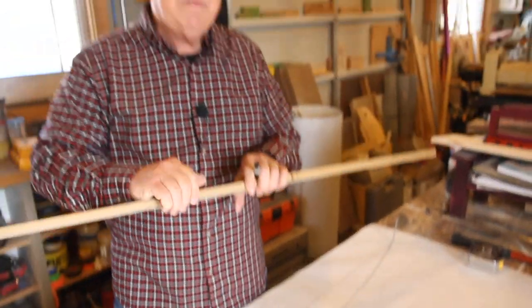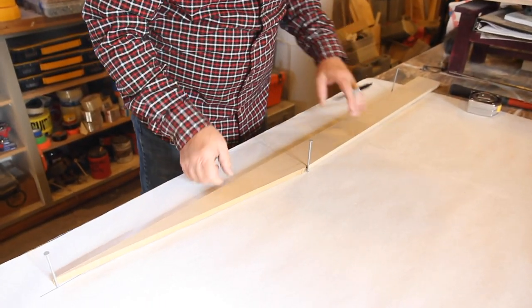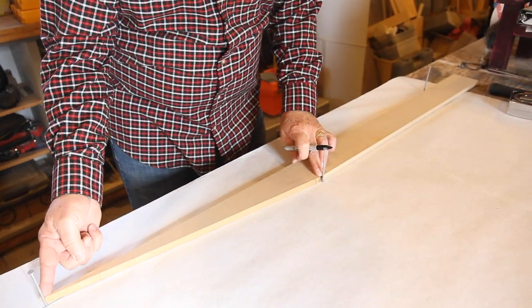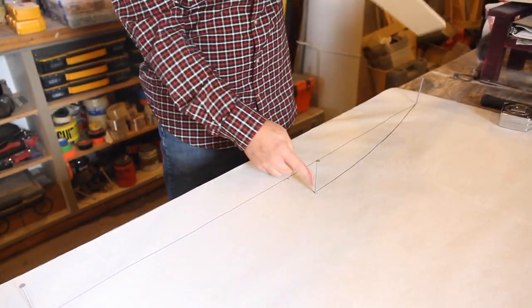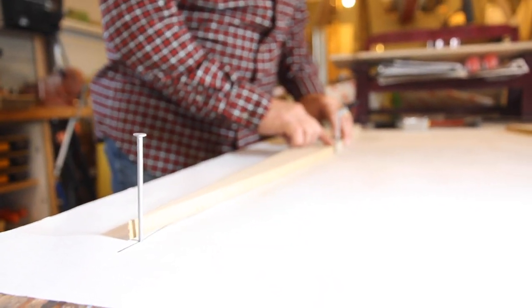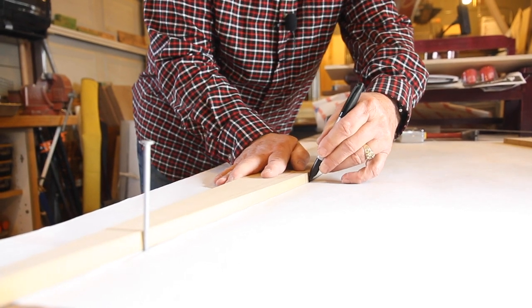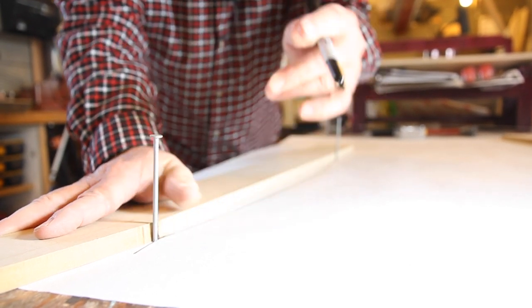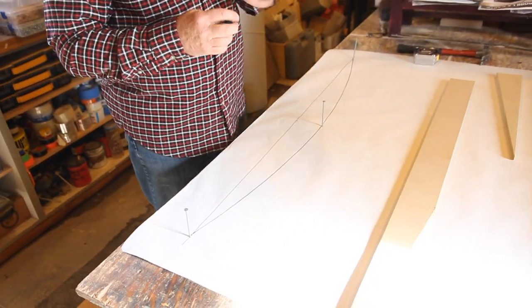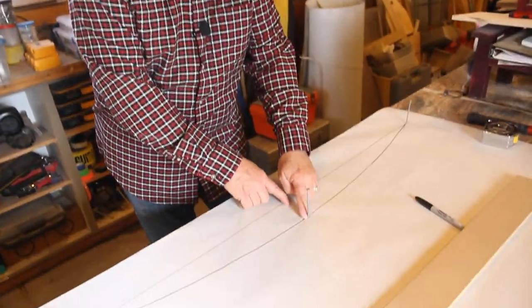Now you can see the arch that was formed. You have a couple of choices: you could flip this around and start with it in between this point and on the outside, reverse the cut, or you could fold the template over and draw it in. Let's go ahead and draw the other side — place the point against the outside of the nail here, put the pen in here, and by pressing against those two nails, just nice smooth action. There is your arch at a predetermined measurement space — 42 inches side to side and three inches tall. We can now pull our nails, cut this out, and we have exactly what we need.